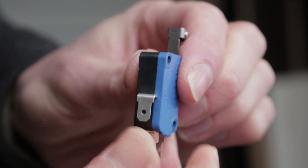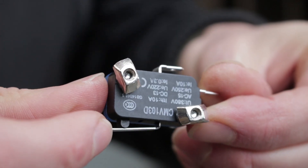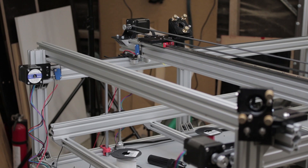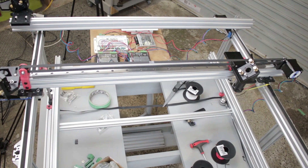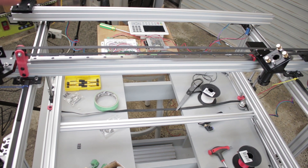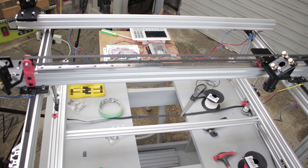Now I need to set up the limit switches for the motors to know where they are. I'm using mechanical switches — super straightforward and reliable — but I need to place them in a good location, so I'll chuck a couple of rotating T-nuts on them and fit them so the levers will contact something solid. I've got these switches set up in the top right-hand corner — and yes, I know, that's technically the top left — but the way I set up the X and Y axes means the controller thinks we're looking at the machine from around here, which is the correct view for all its functions. So the majority of the work will be done in the top left as that's closest to the laser, and then it'll home over to the other side, keeping wiring neat since that's also where all the motors are.